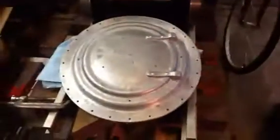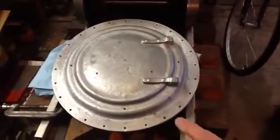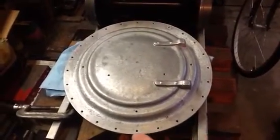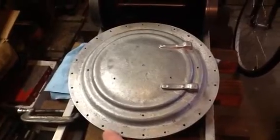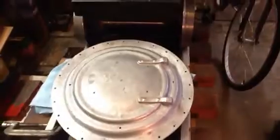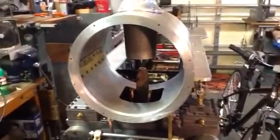There's the smoke box cover, cleaned up a little bit. Not as good as it will end up being, but you can see some of the larger holes. The holes that are slightly larger are drilled out an eighth of an inch to accommodate the 540 fasteners that will go inside the front of the smoke box.